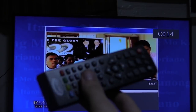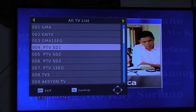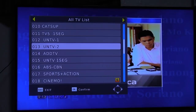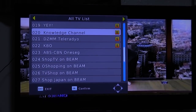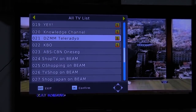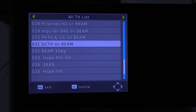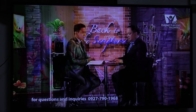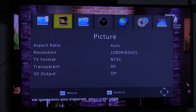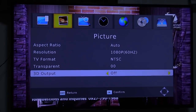This isn't going to be a how-to of how to use the box — I'm just going to go over the basic features because you're going to work it out yourself, it's not rocket science. So here's a list of channels that I found, and some of them will be duplicates because they're on a different frequency or whatever. But if you see that dollar sign there, that means that the channel's encrypted and you can't watch it — those are the exclusive channels for ABS-CBN. You can only get those if you have the official TV Plus box. And if we keep going down, you can see there's quite a lot of channels and there are a couple of HD channels, like Hope Philippines HD. The box is currently connected to the TV with 1080p, and I can show you that if we go into the menu — resolution 1080p 60Hz. You can adjust that all the way down to 480.